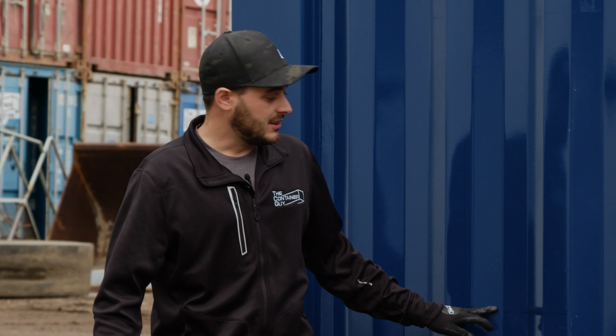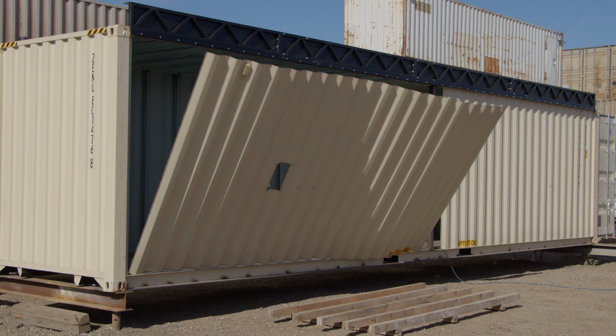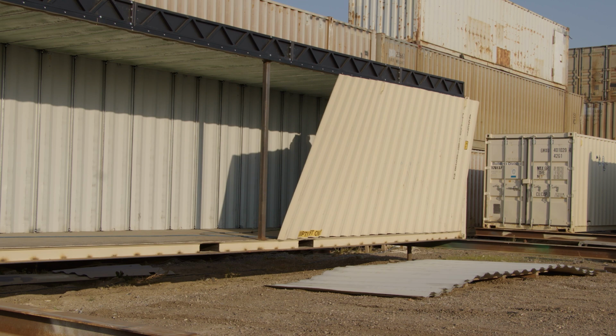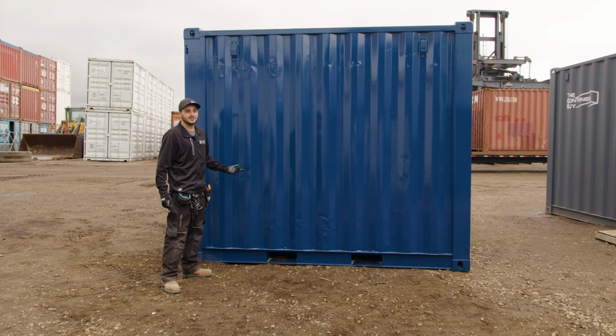And then lastly, I think we're ready to start cutting this thing. So we'll follow William along as he cuts this. Again, I'll also repeat, make sure that when you're cutting these out, you leave a couple tacks along the bottom so that when the panel drops, it hinges outwards. Make sure you have no extension cords laying on the ground so that you don't make an electrical spark or cut your cord, just a safety issue. Sometimes when you're dropping a lot of these, you can just drop them right on a pallet, and that's super efficient for removing these panels afterwards while you're modifying. Be super careful when you drop these, control the fall, just a safety concern, especially if it's your first time doing it and you're doing it yourself.